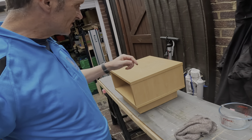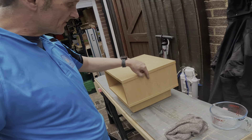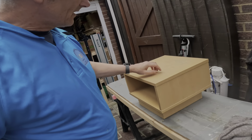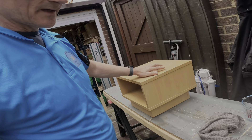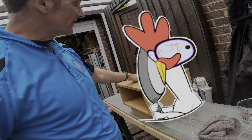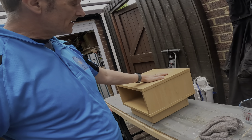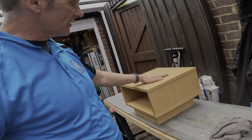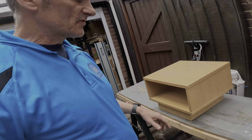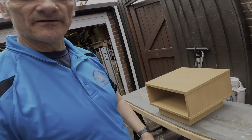First of all I'm just going to prepare it — scrape it and then put some SBR primer on it. It's MDF covered with some sort of edge banding and overlay, so it's a bit rubbish really, but it should hold the tiles. You'll see. I'm just going to scrape it, SBR it, and send a photo — just a quick video.